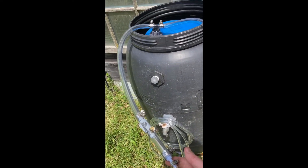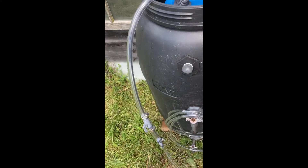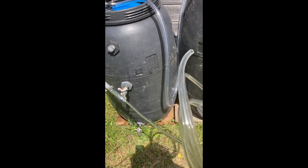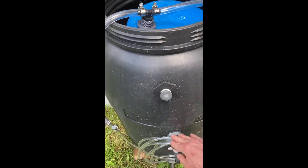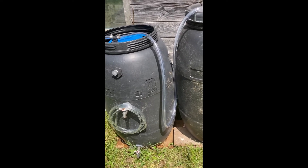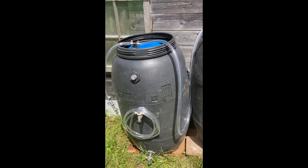Note that this is all plastic — plastic burns. None of this is approved for gas use. Ideally this should all be copper, plumbed and piped according to all your local and national codes. This is dangerous. This will burn. I'm going to put a metal tube on the end of this hose first, but this stuff will burn. Be careful. If you don't like it, don't do it. If you're not sure you can manage this, don't do it. Have a fire extinguisher on hand and be ready to run if you need to. I highly advise you not to do this — I'm just showing you how it can possibly be done in a very simple way. If you go any bigger than this, you need to be a lot more diligent about gas codes, fittings, and flammability.